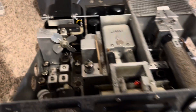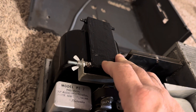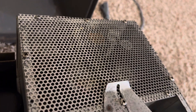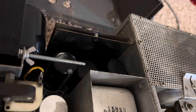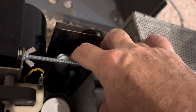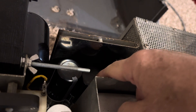Well, it didn't pay off. I was never able to get this transformer down in voltage. This transformer, when you give it 123 volts AC — which is what comes out of my wall sockets here — puts about 850 volts out on the secondaries for the final amplifier tubes. The way I've arranged this radio is that two of these capacitors are in series for the B-plus for the final, which is supposed to be about 700 volts, and there's one for the 340 volts B-plus.